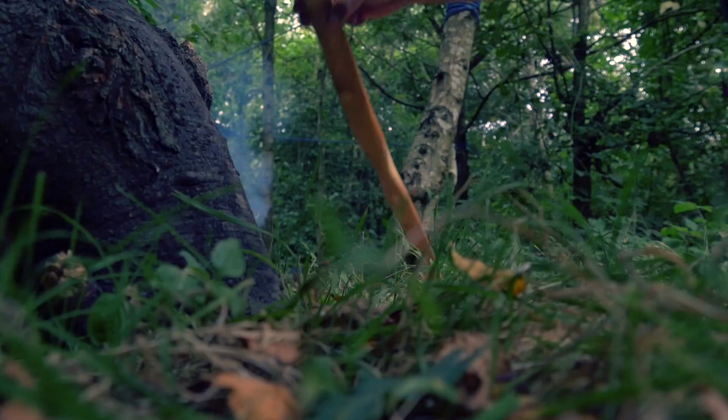The stave for this bow was harvested 8 months ago, and I've worked the bow down to dimensions that I've guessed may be about right for a hazel flatbow. Since then I've oiled and heat treated the limbs over the campfire, hopefully heat tempering them to make them a little stiffer. But there's no avoiding it. Now I have to start bending this Meare Heath inspired hazel bow.